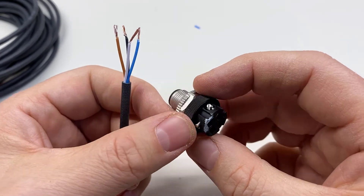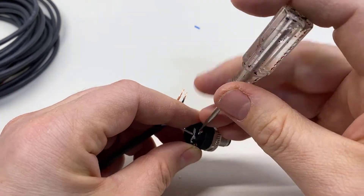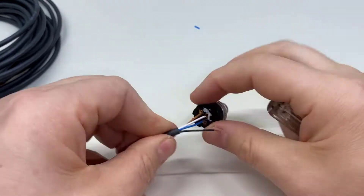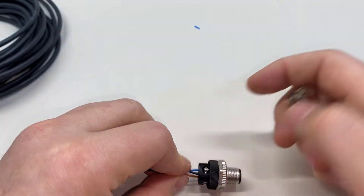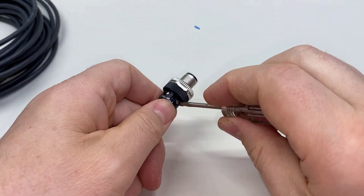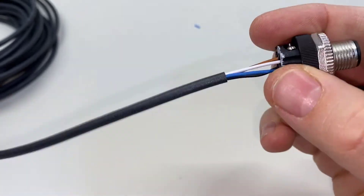I also opened up all of the screws on the terminals, because when you get a new connector, the terminals are usually closed off or the screws are tightened in. Let's start with our white — put that in there, get the screwdriver. White is number two. Blue is going to be number three. Brown goes on the other side of the white, because that's number one. It gets a little harder to hold with each wire. Number four over here is black — we can still see that black mark to verify. Now give each one a snug to make sure I didn't get lazy. A quick visual inspection — none of the conductors are hanging out and touching another wire. Looks good.